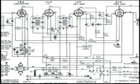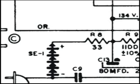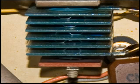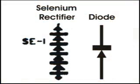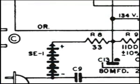This is the diagram of the radio, and if the Selenium rectifier needed to be replaced, here it is in the wiring diagram, and this is what the Selenium rectifier looks like. If that needed to be replaced, I would be replacing it with a modern diode, and it would look something like this in the circuit.